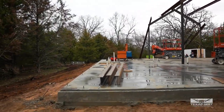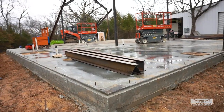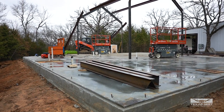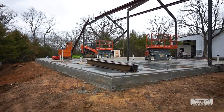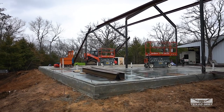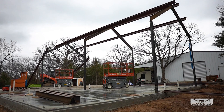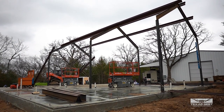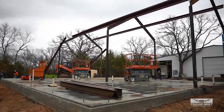I made the decision to go ahead and stand these frames up independently, and then we'll have each kind of L-shape come up and tie on, and we'll just duplicate those. A lot of these are already cut. On these end walls, we'll be using these eight-inch I-beams. Your thickness of material really depends on how far you're spanning. This is not a huge build, so you don't need excessive steel, but even what we're using is very durable and very strong - way more than the strength of a two-by-six.